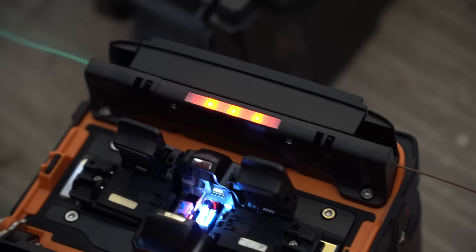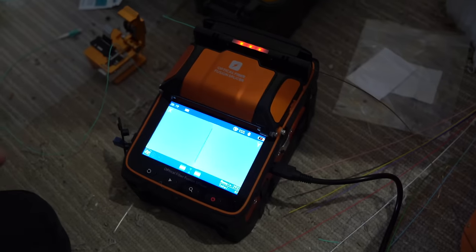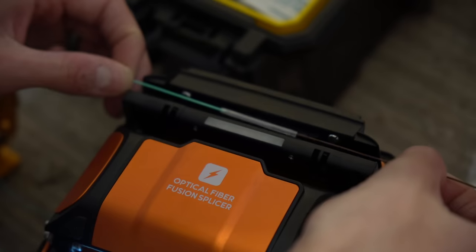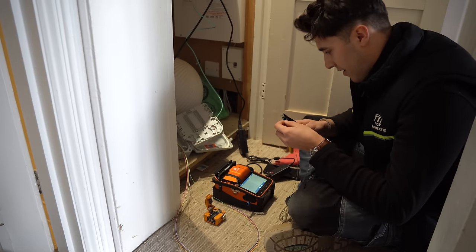Open the clamps and carefully slide the protector on without breaking the joint. Then we open the heat shrink oven — it'll just beep when it's done. That's it — a nice heat-shrunk joint protecting the splice.